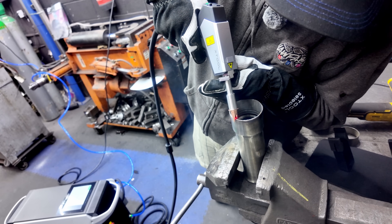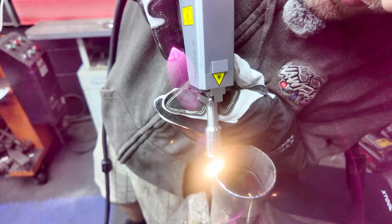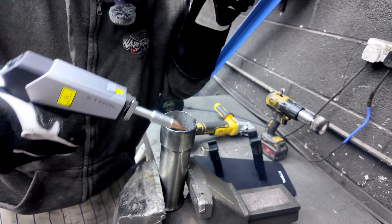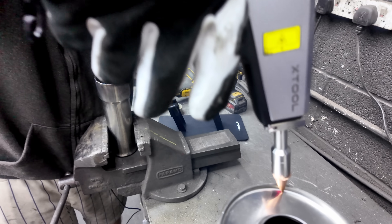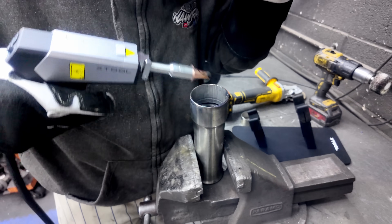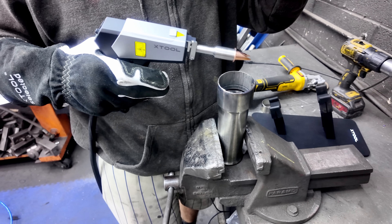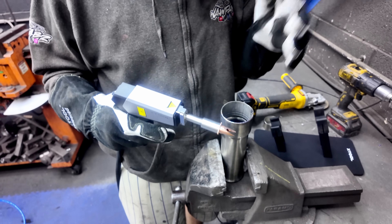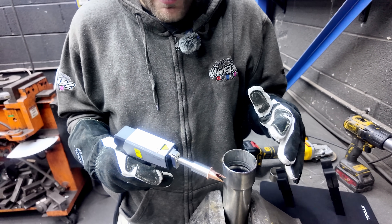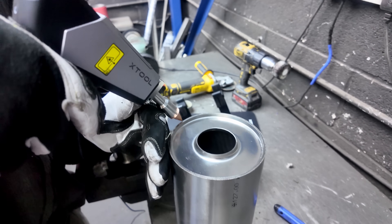Like a dream. Now it's actually quite hard here because I've got to keep the prongs pressed against this for it to earth, so I'm actually struggling. But on the Mona Lisa I can just rest the prong on there and run it round, so I'm pretty sure we'll be all right. It's a little grey and that's probably down to my settings rather than the welder itself — as we saw in the last video I had to play with settings to get things looking nice, so we might be in the same scenario. But I'm pretty confident I can put a tack on the Mona Lisa, so let's see how this goes.